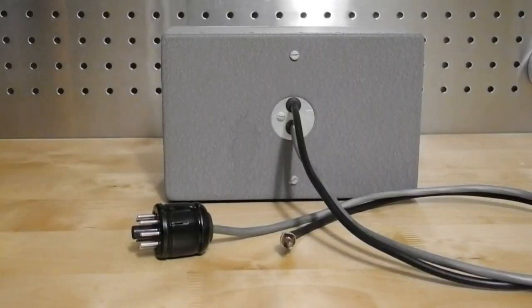On the rear panel is a cable with an octal plug that connects to the receiver to pick up the high voltage B-plus and tube filament voltage. The Heathkit AR series of receivers featured a suitable octal socket on the back to provide these voltages. Other radios could be modified. It requires either 6.3 or 12.6 volts AC and from 150 to 250 volts DC. The other cables are shielded coax with a phono connector that would connect into the IF amplifier of the receiver, which required an IF frequency of approximately 455 kilohertz.